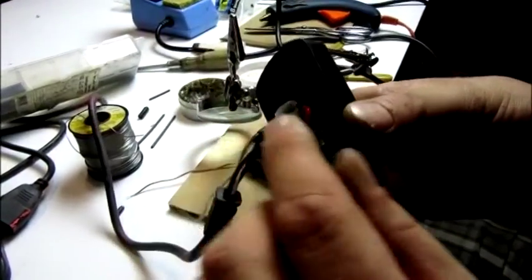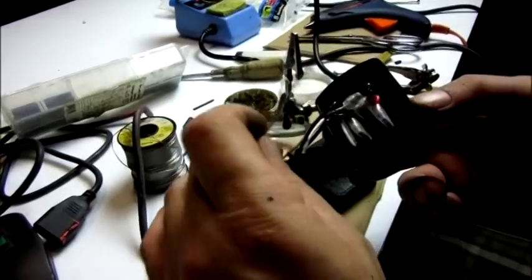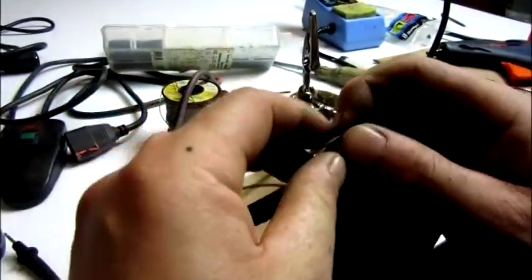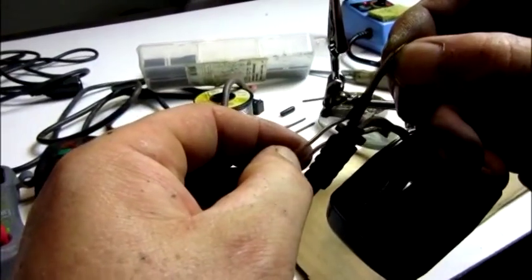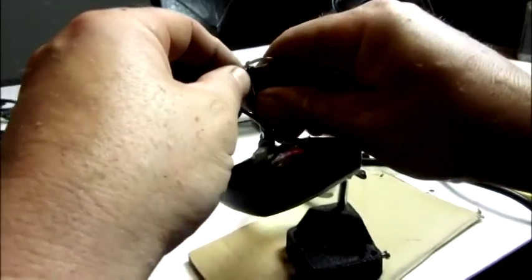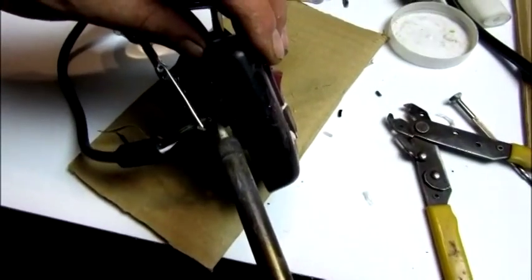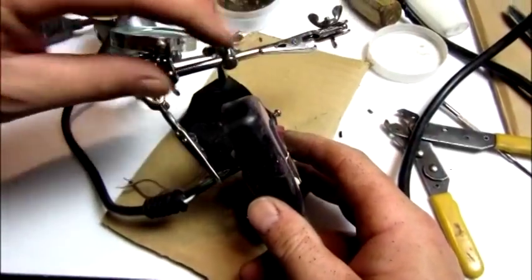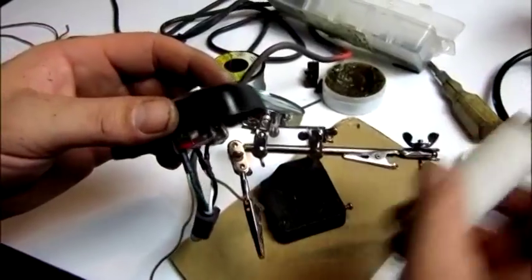Same thing with the green wire — bend it around. I didn't tint that green wire so I need to add a little bit of solder. Take your other wire and your shrink tube — pull that shrink tube as far away from where you're soldering as possible, because heat near shrink tube is bad. Put it in an alligator clip. All we need to do is touch that all together, make it all hot and make it all one. Don't use too much heat or the rubber around the wires will pull back and you'll have to start over. Make sure it's cool to the touch, pull that shrink tube right up over the connection, take your lighter, and shrink it.